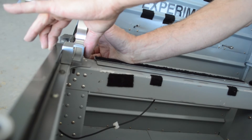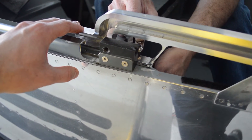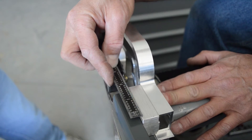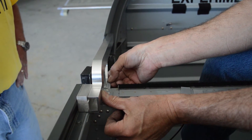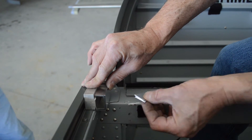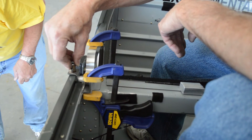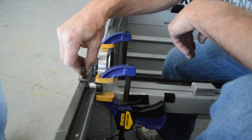You're going to start with the side corresponding to the roller that was furthest aft in the marks that we made early on. Using the spacer block, align the S-Track so that the vertical portion of the track aligns with the slot you cut earlier. Also, please be aware that the track has to be far enough forward for the roller to clear the block at the aft end of the canopy track. For most installations, this means that the front edge of the S-Track is going to be about 3 inches in front of the front edge of the block. When you get this in place, use the spacer block to get an idea of where the final spacing for the track will be. You'll likely have to add a few shims under the trigger guard area and under the front of the track. Clamp the S-Track in place, turn the screws on the spacer block clockwise to loosen them up, and carefully slide the spacer block out of the way. Test the rollers to see how they do in transitioning into the S-Track and rolling up the vertical portion of the track. Make adjustments as needed to get a smooth transition and clear the block.